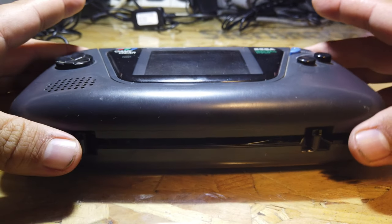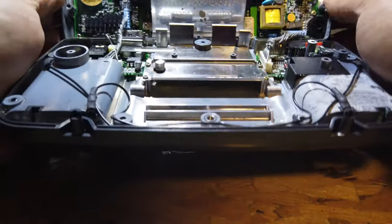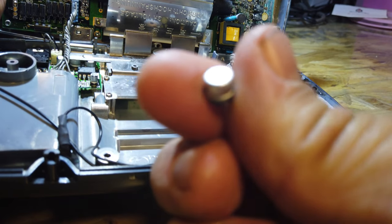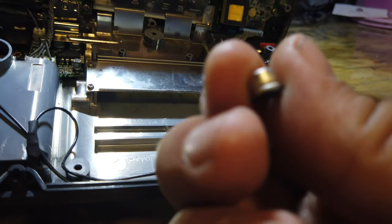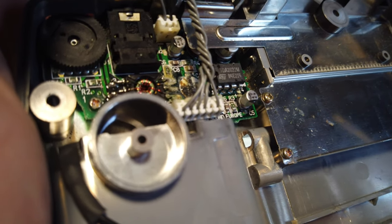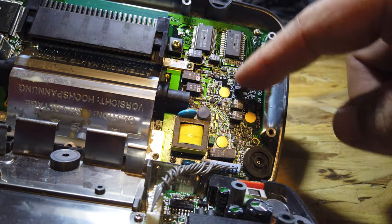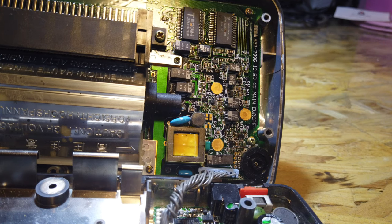Taking this one apart - this is the one with the capacitor issue where we can see the screen at a funny angle. Immediately there's an issue: a little capacitor has dropped off the board. I bet that's probably off the soundboard somewhere, causing zero sound. I've spotted it right in here behind that cable - there's a space where it's missing and it looks pretty corroded as well. That's why we're getting no sound. But all of these capacitors on this board need replacing.